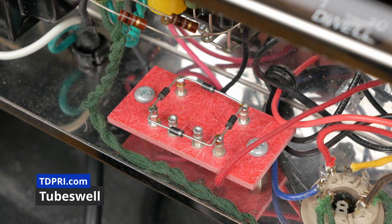You can do this by stacking and wedging multiple pieces of wood underneath the hole inside the chassis. I didn't do this on my first try, and I bent and twisted the chassis. I had to bend and hammer it back into shape. The scuffed lettering on the control panel serves as a continuous reminder of what happens when I do things outside of the supervision of my handler.